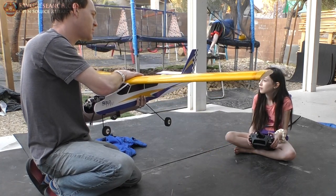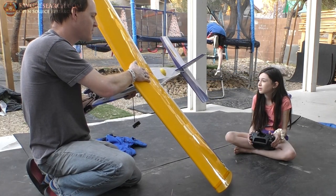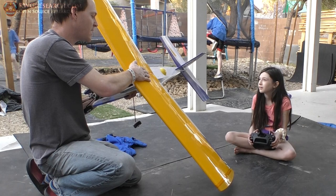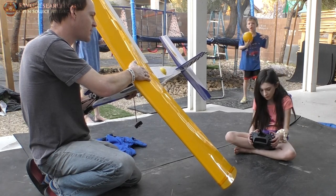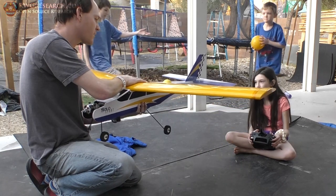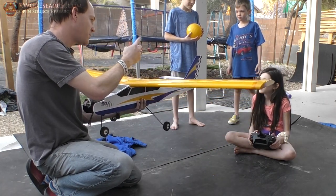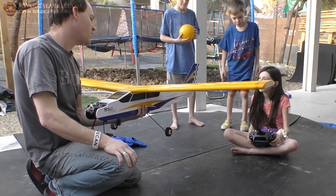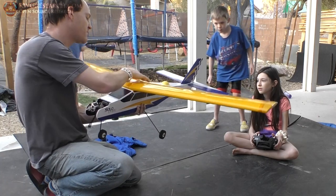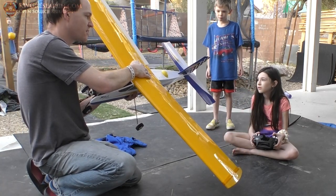So now it's going to try to level the plane. But if you turn that off — okay, you're going to bring it back down. So that's safe mode — that's auto-level stabilization mode. There's a three-position switch: zero, one, and two. Zero is all the way up — that's normal, like you have full control. All the way down is stabilization. And then I'm going to do something with three.